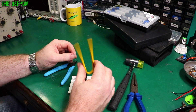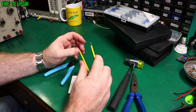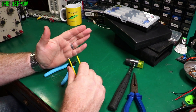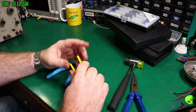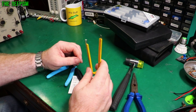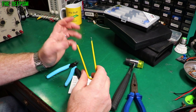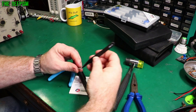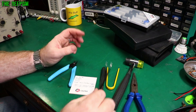This is a basic beginner IC puller. It's got hooks that you hook around the IC and pull it out. What I don't like about this style is that when pulling you're putting a lot of stress on the board, and if it's only soldered on the top side you can actually rip all the traces off the circuit board and pull the socket out with it. So I don't like to use these that much. They are cheap, which is the advantage, and as long as you're really careful you can use them. My preferred way of removing ICs is actually to use some angled tweezers — get them underneath the end of the IC and gently lever it up on each side gradually, and it'll come up. I actually prefer that method.